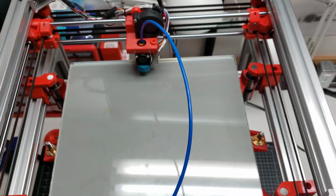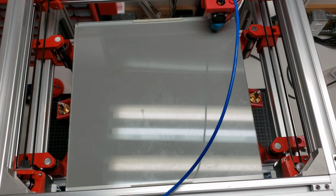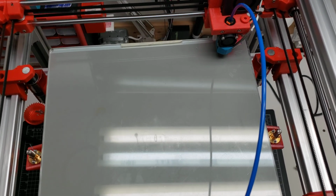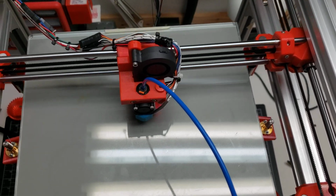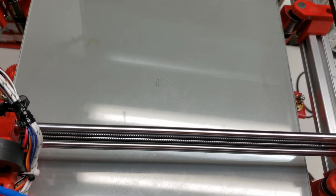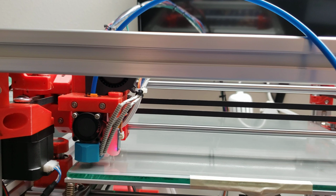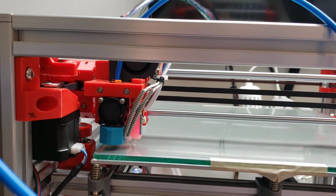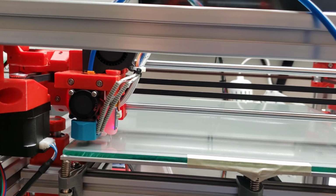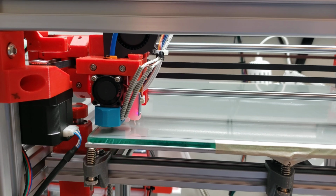You can kind of see the motion of the axes here. And this belt arrangement is the Core XY, where you have an alpha and a beta stepper, and combinations of how they move will move the different axes. There's only actually 2 belts here, but they loop all around, and by moving one stepper motor a certain amount and another stepper motor a certain amount or not, and whether they're running both in the same direction or in inverted directions will determine how this moves through the X and Y coordinates. It's all very slick. I certainly did not come up with this.